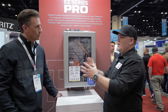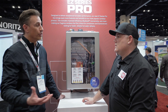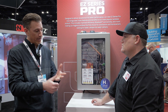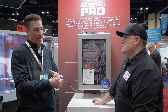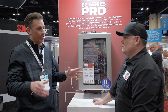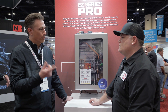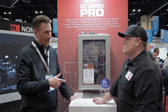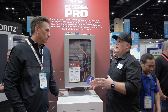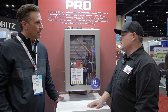Another product that comes with this is our bundled kit, which is the EZTR kit. We have that in a 40-gallon replacement, a 50-gallon replacement, and a 75-gallon replacement. So if that installer just wants the easy answer to everything, that kit is the solution for it. It comes with 25 feet of 2-inch polypropylene, comes with the isolation valve. Anything that you would need at installation, you have it right in that kit. Your warranty is significant because it's really 25 years on the heat exchanger — nobody else in the industry is touching it.